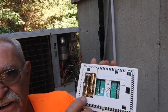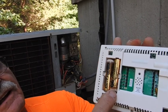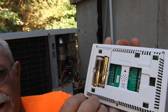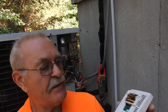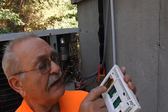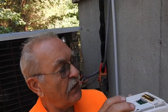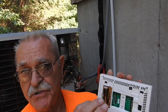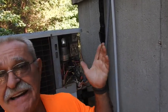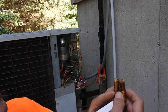Here's the reason why you should always check your batteries at least once a year, or every six months if you can. Look there really close — we have a tremendous amount of corrosion on the battery terminals. Those batteries are actually failing; they've been in there so long. There's a slight possibility that's the issue. The only way it could be is if the corrosion has made its way into the circuitry on the circuit board and actually fused or closed the circuit on the cooling side, continuing to send the signal out to the air conditioner.